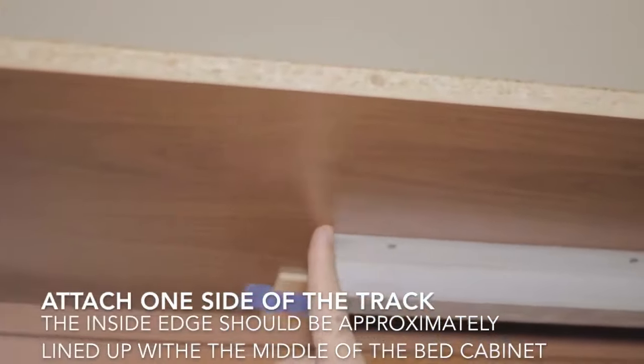To secure your frame inside the cabinet, you'll pull the floor yokes all the way up against the rear of the front toe, then bolt your wall mount brackets to the outside of the left and right floor yoke. The bolt head should be on the outside of the wall mount brackets and the nut should be on the inside of the left and right floor yokes, with a washer inside and a washer outside. Center the frame in the cabinet and then secure it to the wall — what you're securing to in a wood-framed wall is the bottom plate, a 2x4 or 2x6 that runs underneath the studs horizontally. With a helper, you lift the frame up at an angle so that you don't hit that valance up top, and place the knobs on the left and right rails into the hooks on the floor yokes.